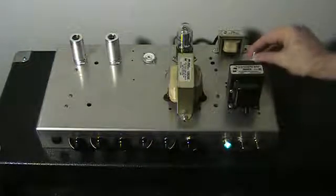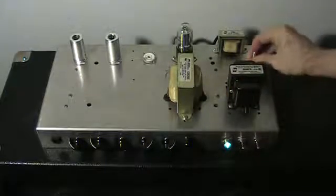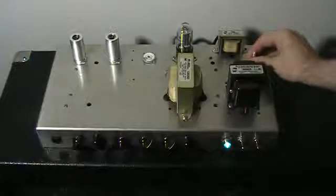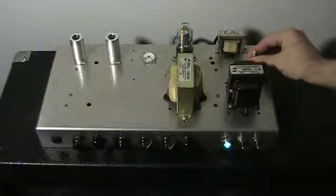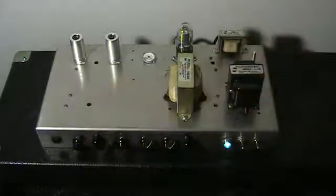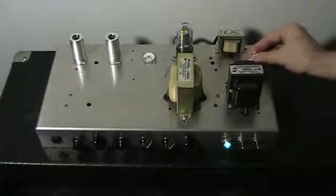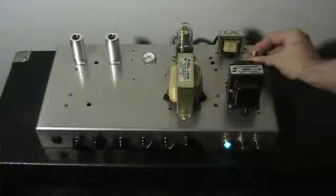So if you turn it — turn our volumes up here so you can hear what's going on. When I turn the pot you can hear the hum. Right there we have the master volume all the way up and the second gain all the way up, and there's only hiss. You turn the thing and you get hum as you go off from the sweet spot, go away from the sweet spot.